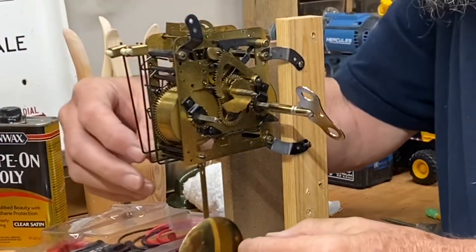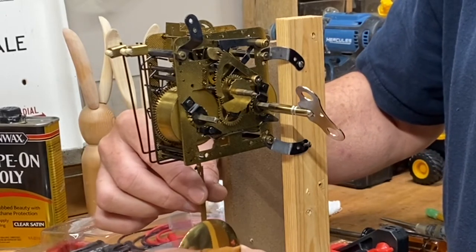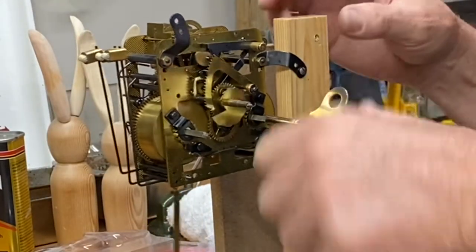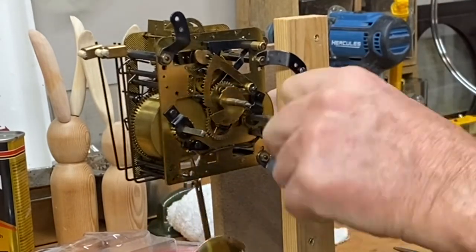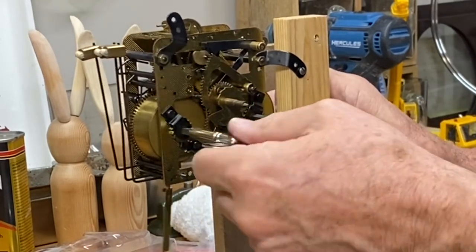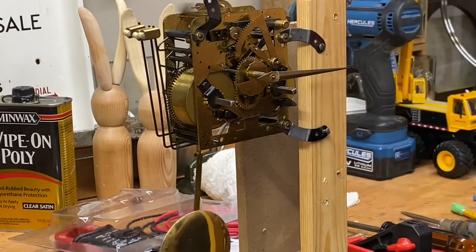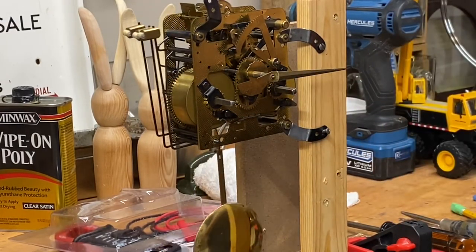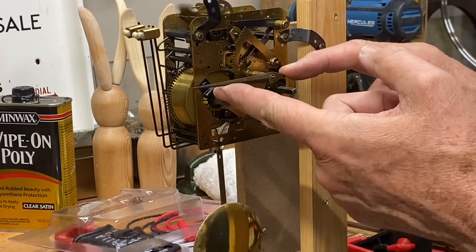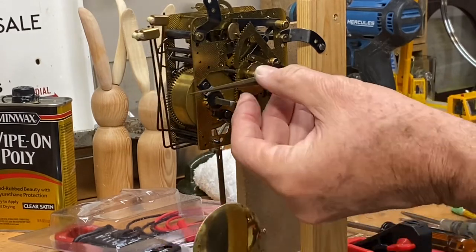It's wanting to run with only a half a turn on the main spring, which is a good thing, but it is out of beat so I'm going to set the beat here quickly. I think that's going to run, so we'll leave it on the stand for 24 hours or so, and that'll allow me to get the cabinet straightened out. I'll wind it up about halfway — you can see it's starting to go into action. And that is the half hour... and that's the hour, of course the hand is not in the right place yet.